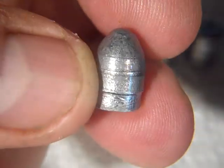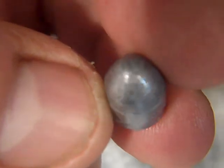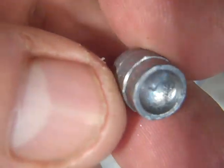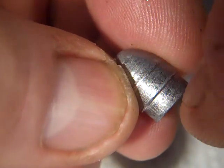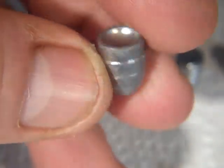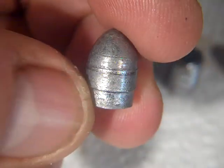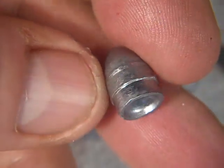I'm going to show the finished products here of the 38 rimfire experiment. This is powder coated and swaged to spec. This has got a complete layer of powder coat over the whole thing. There's powder coat on the bearing surface, there's powder coat on the heel and in the hollow. So it's completely sealed by powder coat, and it was swaged after it was powder coated, so it's to the right specs.